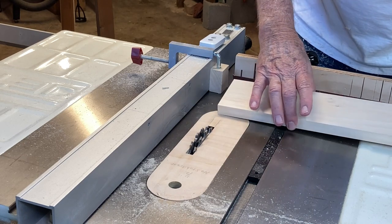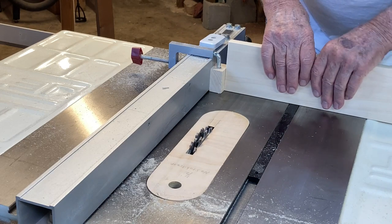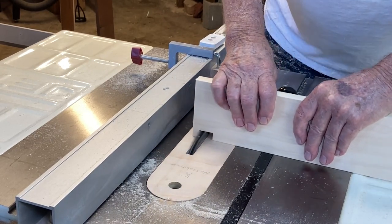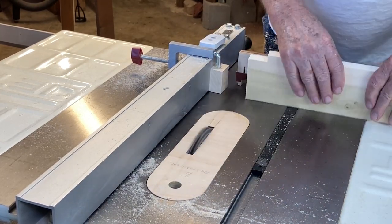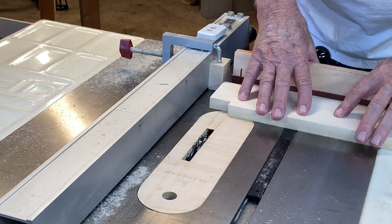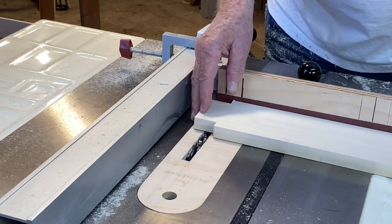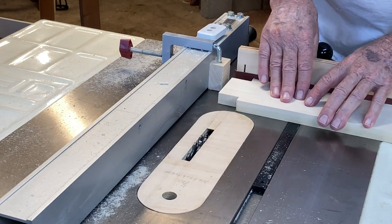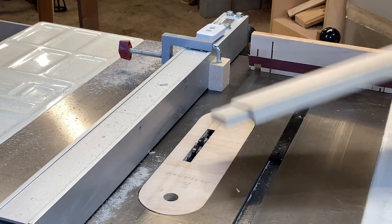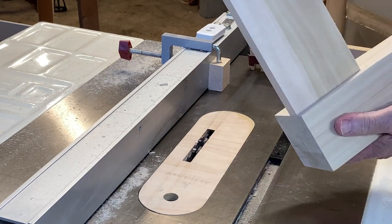I've cut the aprons to four inches wide and now it's time to cut the tenons. I've put a stop block to measure the depth of the tenon at an inch and a half, then I'm cutting the width of the tenon. I've readjusted this to cut the cheek on the tenon, leaving my depth stop in exactly the same place. One important thing when using a dado stack like this: you have to put a lot of downward pressure, because all those blades will try to raise the piece up — and then you end up with an imperfect cut, which can be very frustrating. Let's see how these tenons fit the mortises — right off the table saw. Yeah, that's good — that's going to make a healthy joint.